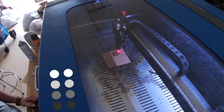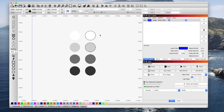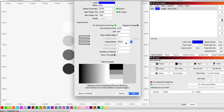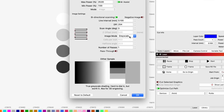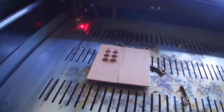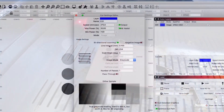What I'm etching here is just a series of circles that go from dark to light — it's a process you're going to go through on every type of material you're going to etch. You're trying to find a balance between the speed and the power levels to give you some variance in colors dark to light. In Lightburn, I'm taking that image layer and changing the mode from dither to grayscale. At the bottom you'll see it say, 'True grayscale shading is hard to dial in, but it's worth it,' and I sort of agree. On my first attempt, I had used the settings I was using for plywood and you'll see very little difference in the actual colors of the etch.